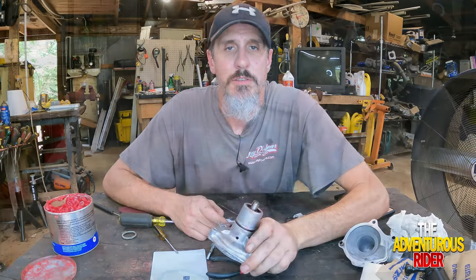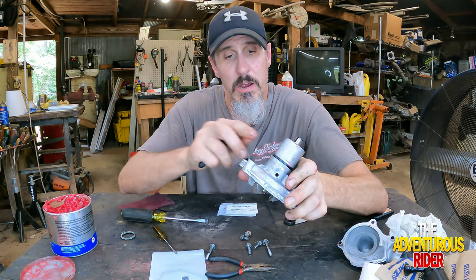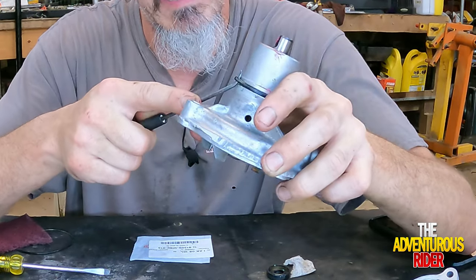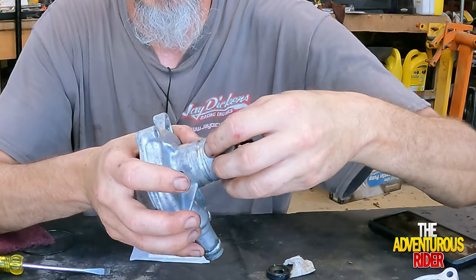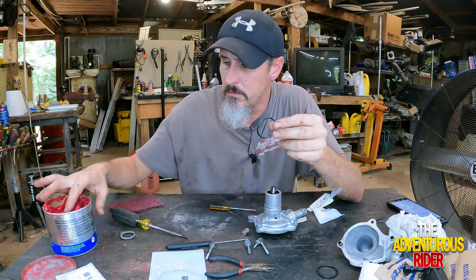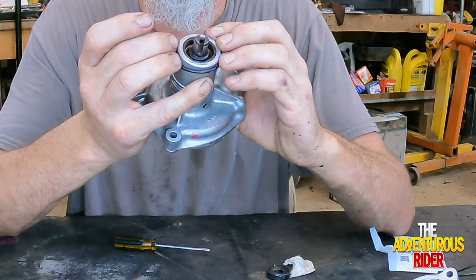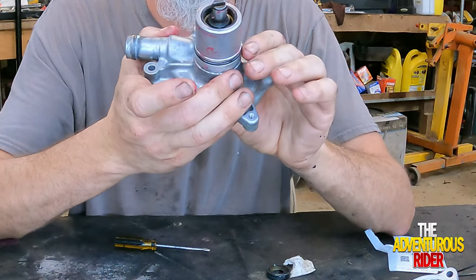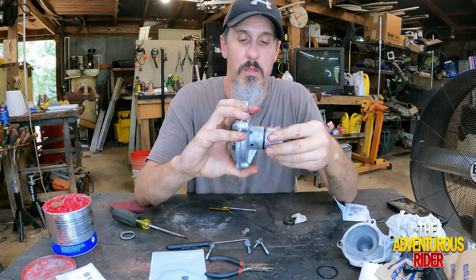Your next O-ring is the part number right there, and it goes right here. To get this O-ring off, just use a little pick, reach underneath it, grab it, and roll it out of the groove, then pull it all the way off. Like we did with the oil seal, put a little bit of grease around the O-ring, put it on, and work it down until it gets to the groove and just barely push it in. Make sure to look at the O-ring to confirm it's not rolled — otherwise when you go to put it in you're going to tear it.